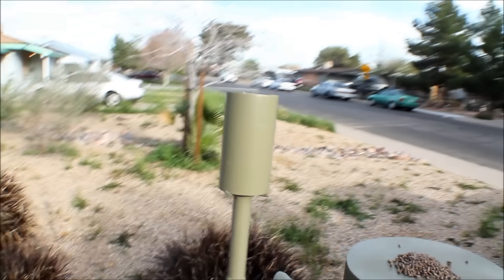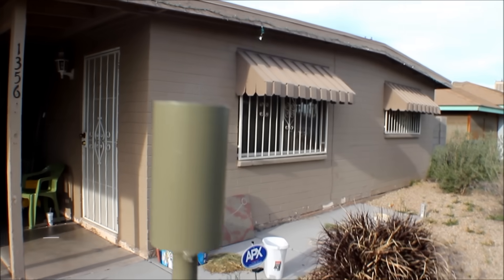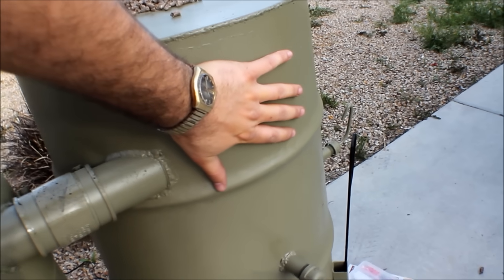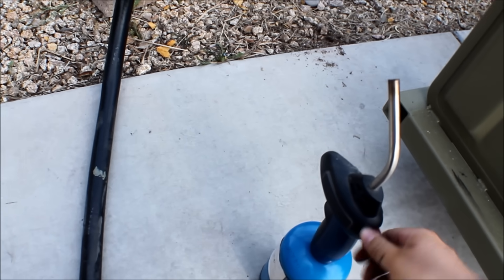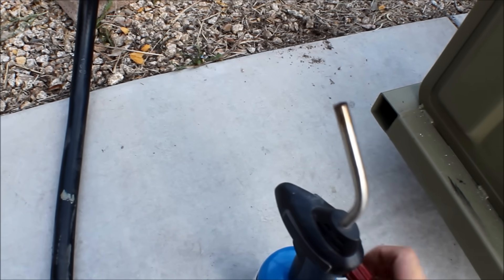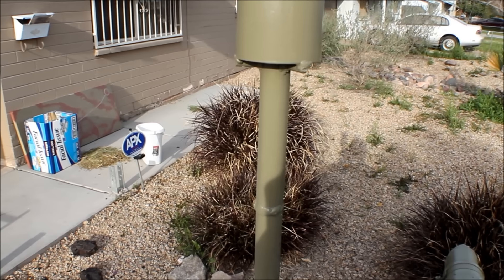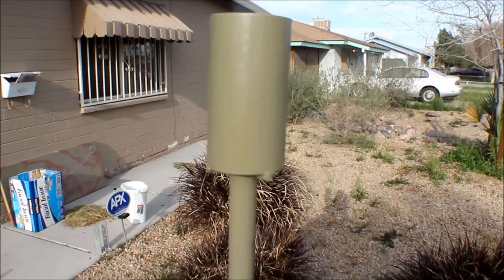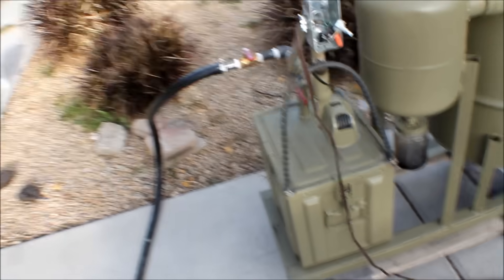It's a little breezy out today. There is some smoke coming out — you can see it up against my house. The barrel's getting warm to the touch. This is about the time when I test the fumes coming out of the torch. I can just light it and they're staying lit, but not for very long — so it's almost there. It's a very invisible flame; you can only see it when it's dark outside. We'll give this just a few more seconds and then it'll be ready to turn on the generator.